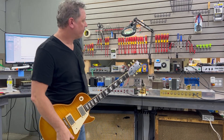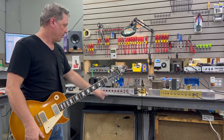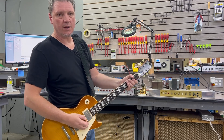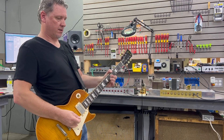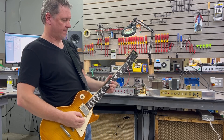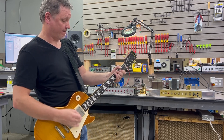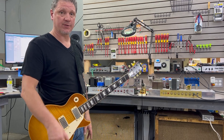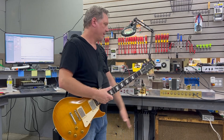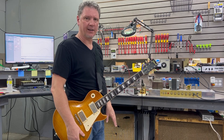So if we listen to that — the green light on the Headmaster is the original 45-100, and the red light is the SuperPlex Mark II in the first mode. That's the 45-100, and this is the SuperPlex Mark II. That's the amount of gain that the original 45-100 tops out at stock. It's worth noting that the AC line voltage for this amp is at 105. If it was at 120, the voltage goes kind of off the charts and it also gets really ice-picky and strident. It sounds much better down here.